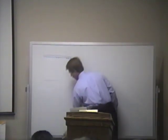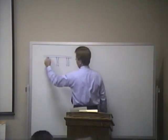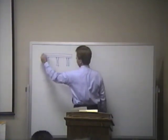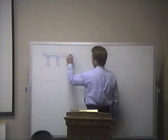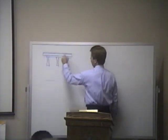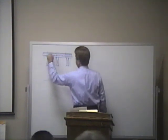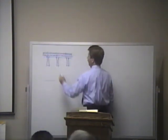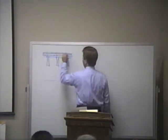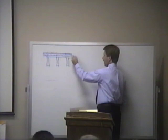For example, there they had, and that depends on the application, wood joist and plywood deck. And it's real easy to come in and put a rigid insulation right there, and then you can put what's called a nailer above it that you adhere to, and you shoot through both of them, and this is your insulation. And then when you put your built-up roof on it, it adheres to this nailer. It bonds to it. It'll melt the insulation, but it won't melt the nailer. So there's several different applications, but we recommend that at that time.